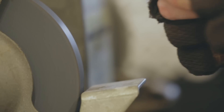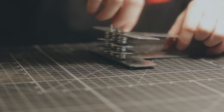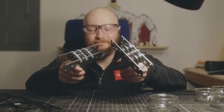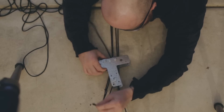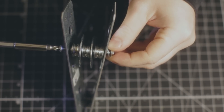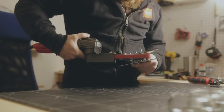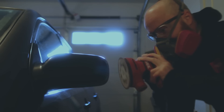Between an attempt to save money and time and my lack of foresight, I only made a single plate for each of the pulley blocks. The problem is that the force on the pulleys causes the entire thing to pull at an angle — the ropes became misaligned and got stuck between the pulleys, causing friction. So I went back to the store and bought two more plates, immediately broke another drill bit, and the rest of the build went smoothly. I have to admit, not using two plates from the start was a dumb decision. Considering how most things I make are barely held together with zip ties and duct tape, I'm genuinely proud of how these turned out — completely made of metal, no jagged edges, they almost look professional. I guess you could say I'm something of a machinist. And as great as they look, they weren't perfect: while testing, I realized there were so many ropes going back and forth that at least one kept getting jammed. So I removed half of the washers so there wouldn't be any gaps for the ropes to get stuck on. As an experienced machinist, I always recommend removing parts until your problems go away.